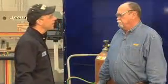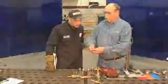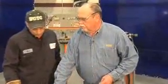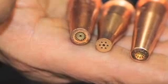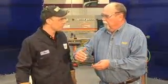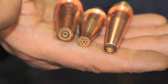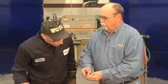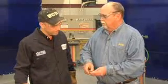Tim, you said the tips are different. Can you tell us some of the differences? Sure. This is an acetylene tip. Because of the burning velocity, we want to keep that flame just outside the end of the tip. When you switch to alternate fuel gases, we've engineered the tip to work with them. This particular one is a propylene tip — you'll notice the recess. When propylene gas burns, we want to keep the flame attachment up close to the end of the tip, so we recess it. There's also a natural gas tip, which has a different depth. Each gas has a different burning velocity, so we recess the tip differently.